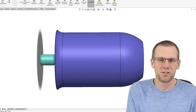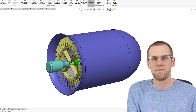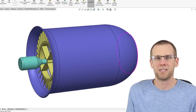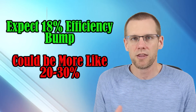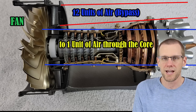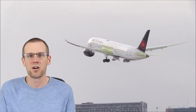I understand that this is a mock-up and certainly does not represent the entire design effort that would be required to make this work, and we'll get to some of the complexities we're introducing. As a result of being able to do this, I would expect to see an absolute minimum of 18% increase in efficiency. And not only are we talking about efficiency — this is also going to change the way our turbines sound. The turbine actually gets quieter because there are fewer exhaust gases coming out of the engine and we're using more fan air to propel the system forward. This would reduce the actual sound output and change the sound we hear from the engine. If you really do like the airliner noise from that engine, it's very different from a typical turbojet engine — this is more of what that radio controlled model engine would then start to sound like.